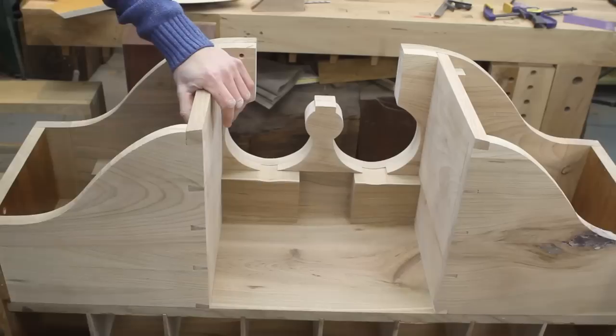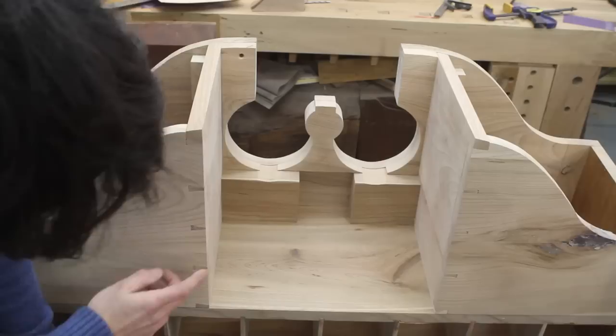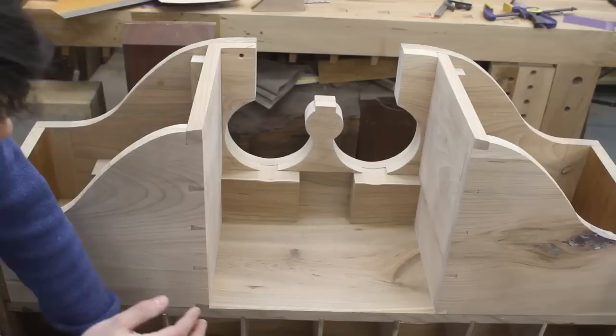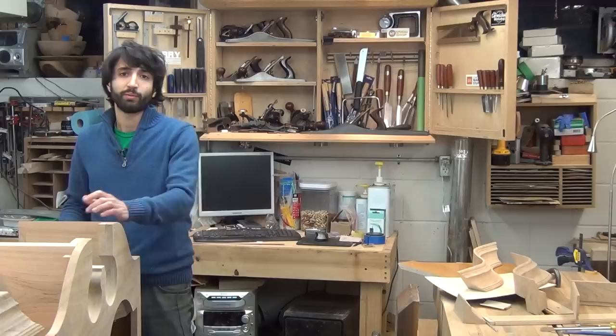You can also see that my carvings are attached in here, and these side pieces are notched around the carvings. I went ahead and did some dovetails up here just to practice — this is totally unnecessary up here, but I wanted to practice on a couple of different things. On this side I tried cutting dovetails as fast as I could, cutting as close to the line as possible, and you can see they're not that great — not bad either, but there are gaps. Over here I tried some really, really skinny pins; this one is just the width of my handsaw plate at the tip. That was really challenging to cut because it's just so small. But places like this, things that aren't going to be seen ever, are great places to try different kinds of joinery or different takes on joinery, like cutting something as fast as possible with minimal cleanup, or a really tiny pin.